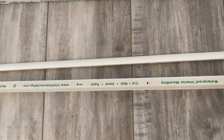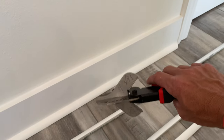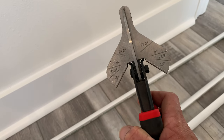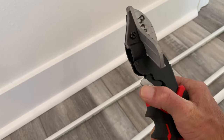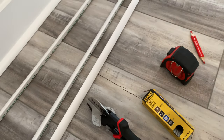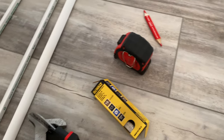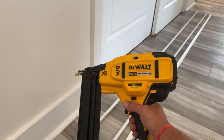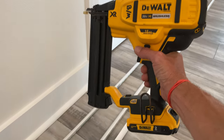These nips are pre-marked with all your angles, which is very nice. They cut very easily — they're a little bit more difficult when you're cutting wood trim, but it can still be done. When I'm doing wood quarter round I usually use my miter saw. We're going to nail them in with 18-gauge inch-and-a-quarter nails. I'm using a cordless 20-volt DeWalt brad nailer.